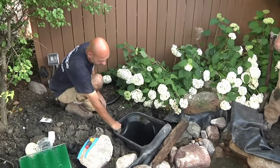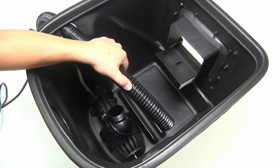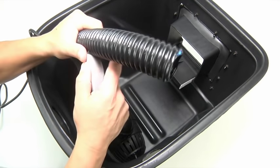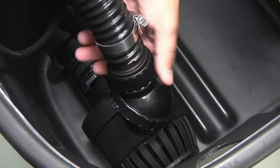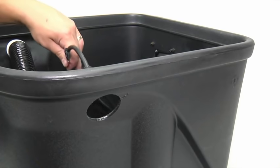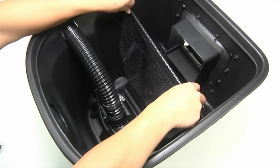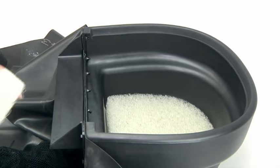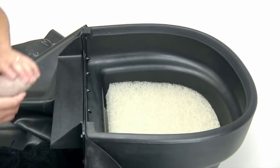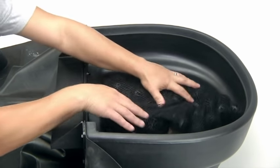Before the pond is filled, you will need to hook up the pump and plumbing inside of the skimmer. Prepare to hook up the pump by running the plumbing into the open side port of the skimmer. Drop the pump in the skimmer and determine the amount of pipe you'll need to connect the plumbing. Cut the pipe and connect the pump to the plumbing with the barbed hose adapter and rotational ball fitting included. Once the pump is installed, run the electrical cord out of the unused side port. Complete the installation by inserting the skimmer debris net and covering the unit with the lid provided. Before turning on the waterfall, remove any dirt or debris from the biofalls and place the filter pads into the unit with a rock to weigh them down. Optional media like bio balls can also be added at this time for additional filtration.